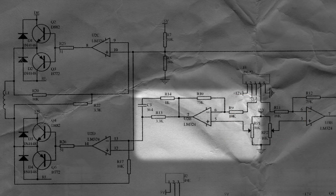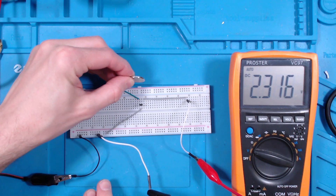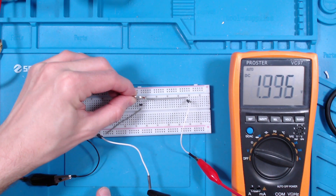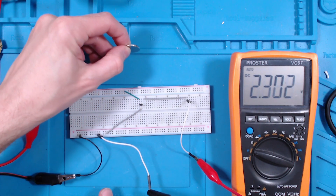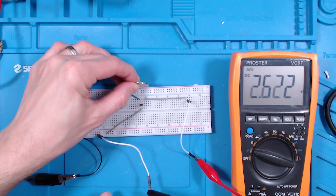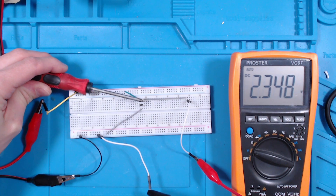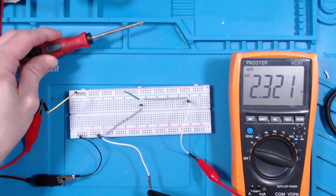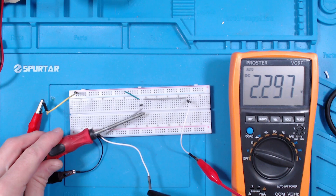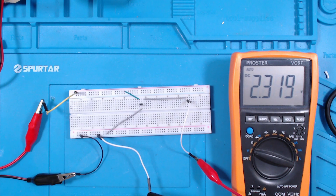This just leaves the control circuit, and it's actually quite simple. But to explain it, we need to understand how these linear Hall effect sensors work. So I've connected up one to a multimeter so you can see what's happening. You'll notice the output voltage changes depending on how far away the magnet is, and if I flip the magnet, the voltage changes in the opposite direction. But you can see how sensitive it is — it even reacts to the small amount of magnetism on the tip of a screwdriver. They're great little devices and come in many forms, but they will only work on one axis. You may have noticed that your tablet or smartphone automatically switches on or off when you open or close the lid on the case — well, it's most likely using a sensor like this one, with a tiny magnet embedded into the lid.